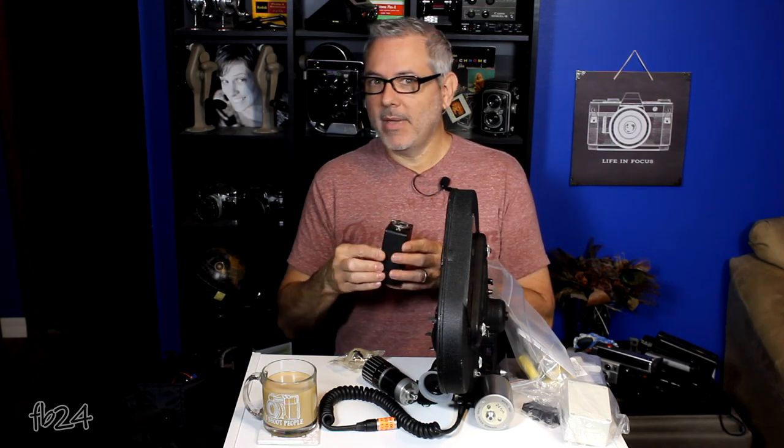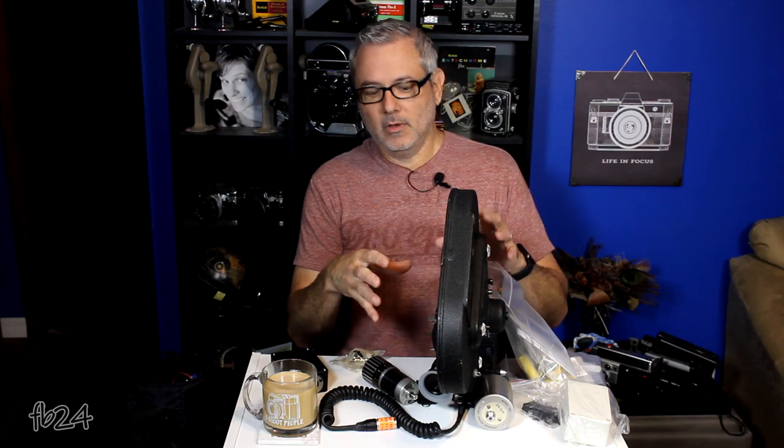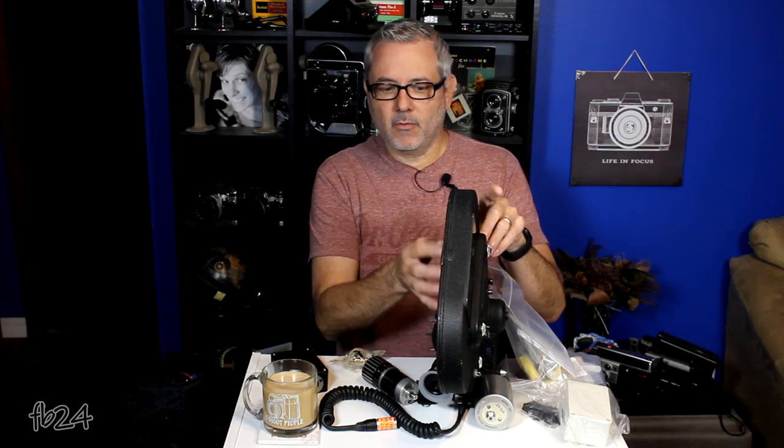So I was super happy. I call this my hole-in-one moment — when you go, holy cow, I did it! I do have an actual hole-in-one, by the way, from many moons ago, but I think this was a better feeling. Now I have the capability of building my own 8.4-volt battery packs for my Arri 16S. I'm going to mess with the milliamps a little bit — I think they're a little low. I've run a couple hundred feet of film through using the magazine and it's still running strong, so we'll see how long it lasts.